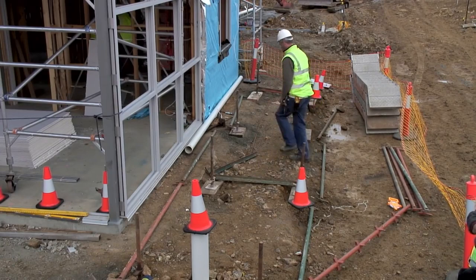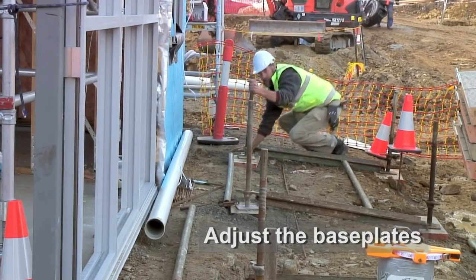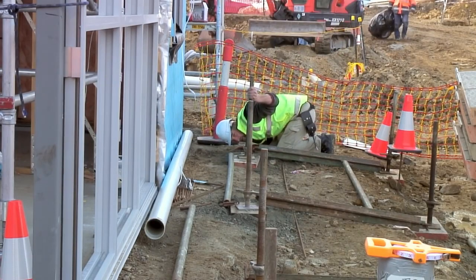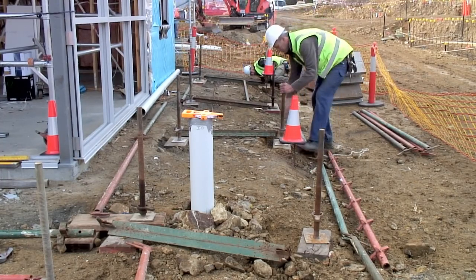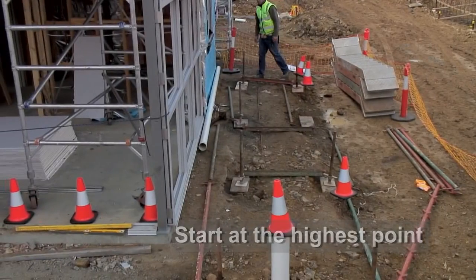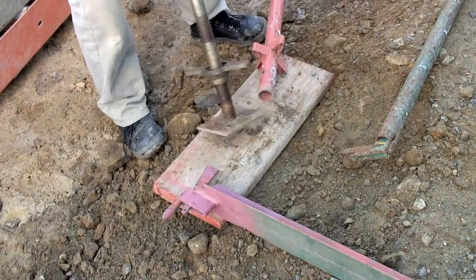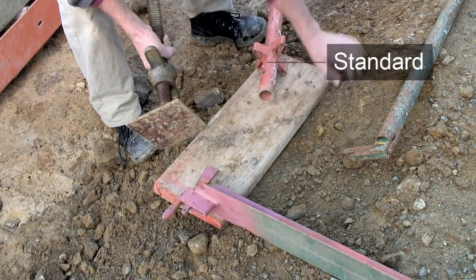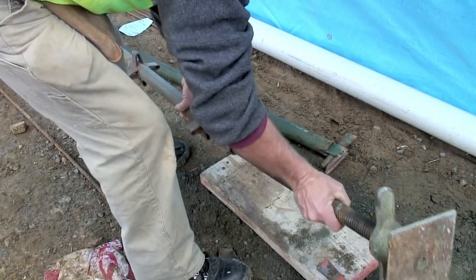You can see how the layout of the base lift is starting to take shape. The base plates should be adjusted to compensate for uneven ground. When making adjustments to the base plates, ensure you have scope for adjustment later. Now the first bay can be erected. Try to start at the highest point. Insert the base plates into the standards — do this on both sides.